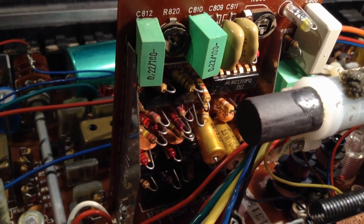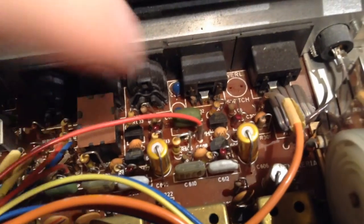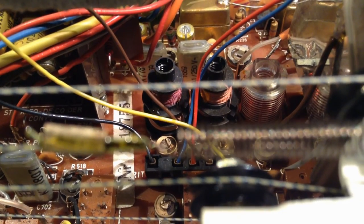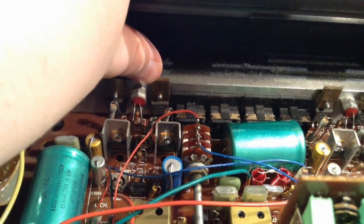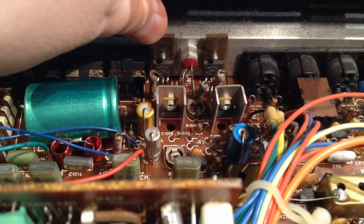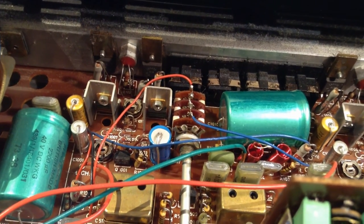If this isn't sexy, I don't know what is. Check out those transistors — check how large the heat sinks are compared to ones you get today. This is the AM section — you can see those variable coils with ferrite screws in the middle. They're on the wall there. One is kind of loose — aren't they supposed to be pressed against the cover? And check out the soldering down there — it looks bad. Maybe they've been changed at some point, maybe someone wanted to fix it.